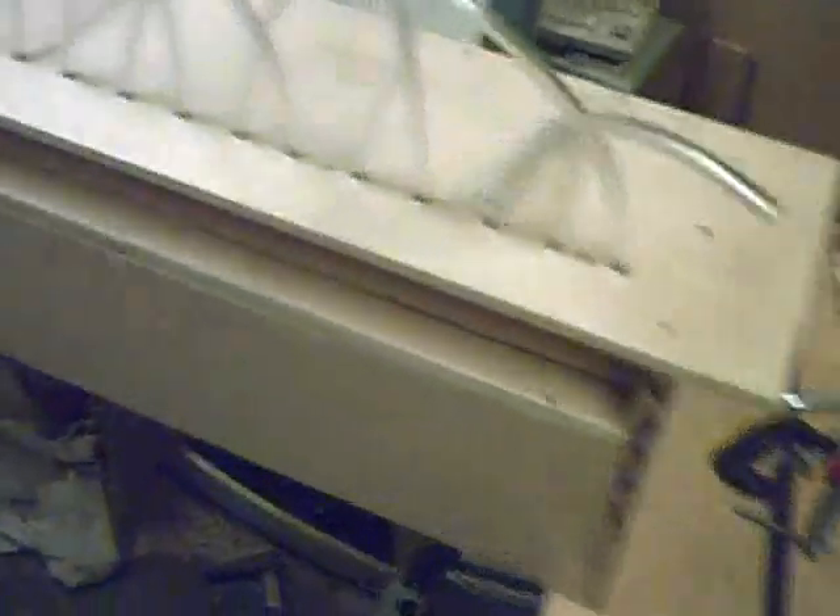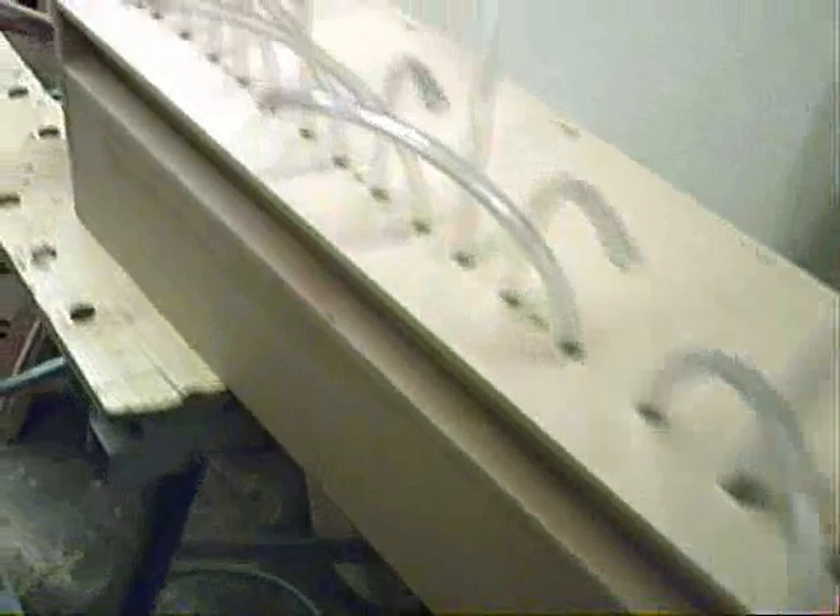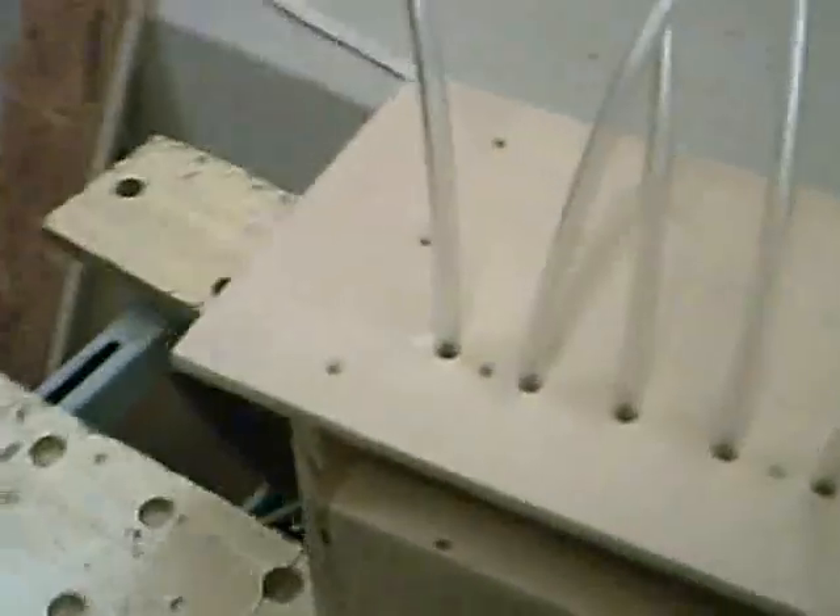There are two at 15mm external diameter, two at 10mm external diameter, and the rest are 8 millimeters in diameter — 31 pipes in total, so 31 holes. Here's the topside of the wind chest — as you can see, 31 pipes sticking up, each one to feed an individual pipe. They just go into the back of the pipe, as you'll see in later videos and in the plans.